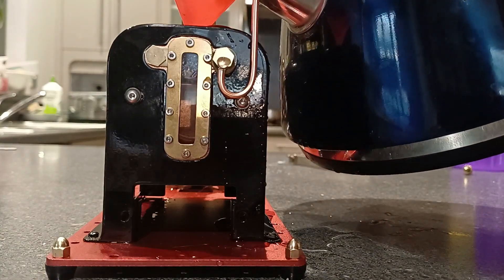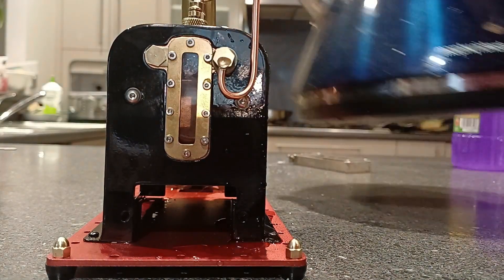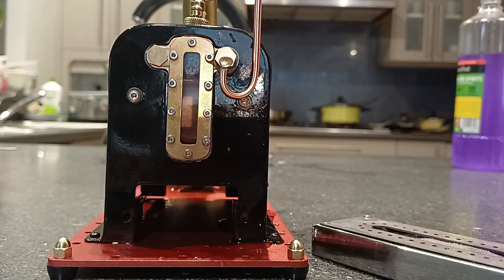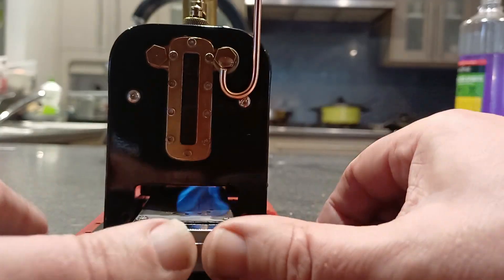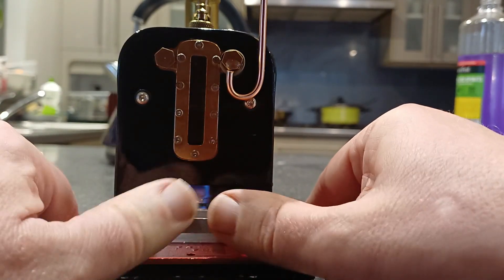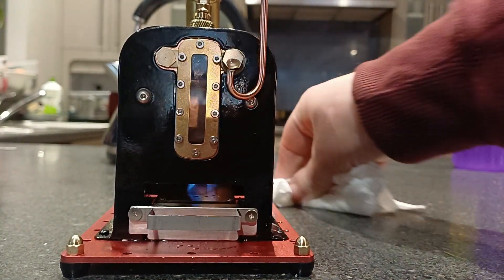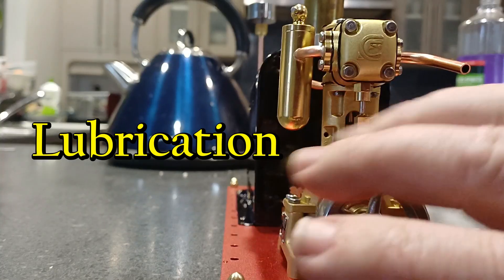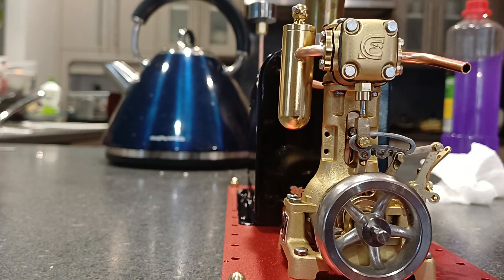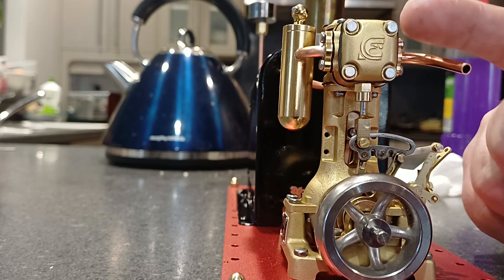So we're at about 75%, I might go up to 80%. There's the safety valve. I'm going to light this burner. Okay, that's burning my hand — so that's good. Well, when I say good, I mean it's working. I'm going to turn this around and pre-oil the cross slides and some gear. I've checked that there's oil in the condensate oiler. The only change from the first run — apart from being a bit run in and me a bit less nervous about things going wrong — is I've moved the valve in the chest about a third of a millimeter. No idea if it'll make any difference.